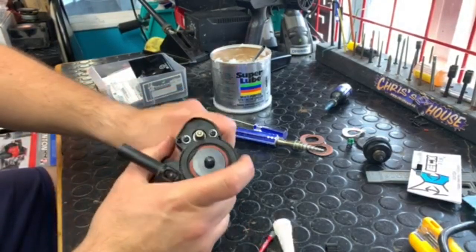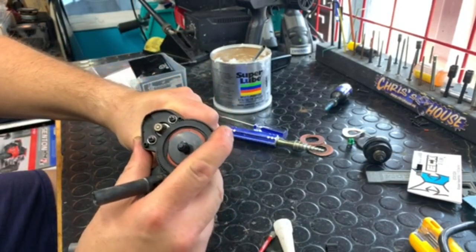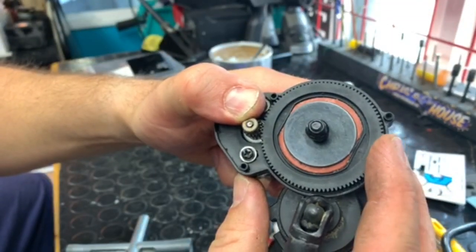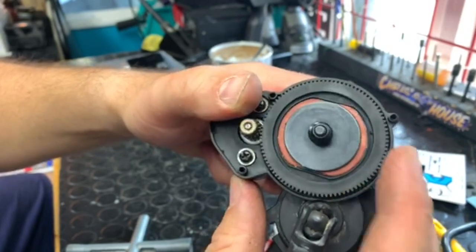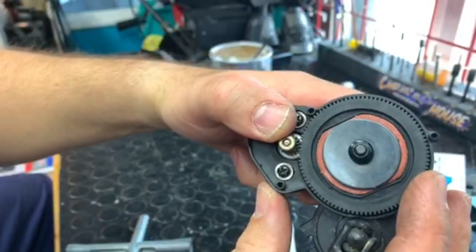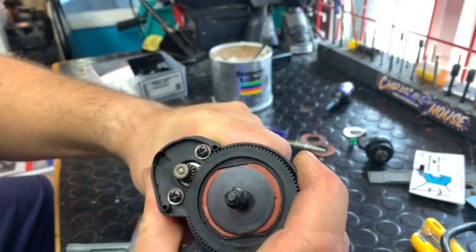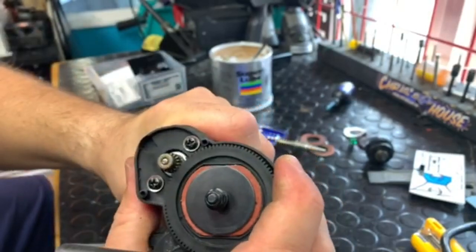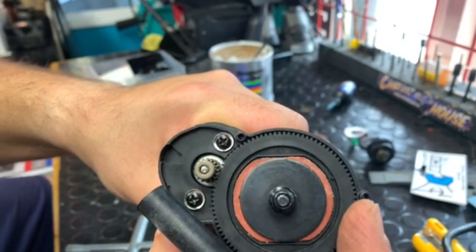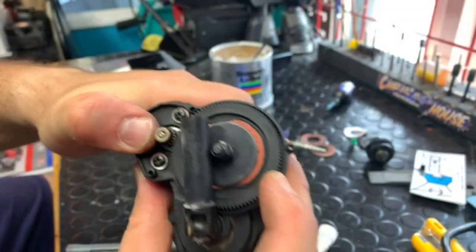Okay, so we're going to loosen this off, and I'm going to rotate this motor away, okay? Oh, I almost did a great job there. A little too loose. Look at that, look at that. Okay, I don't know if you guys can see, but just that little bit of play. Let's rotate it. Just that little bit of play. Now when you really zoom in here, you can see it's a little too much. So let's just tighten it up just a hair. It's getting that right in between. Yeah, good. Just a bit. Very, very hard. And that's a little on the tighter side there, but you still get a little bit of play. Good. Okay, just a bit.